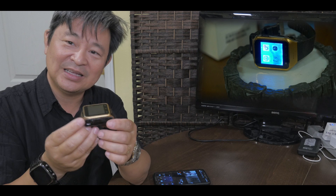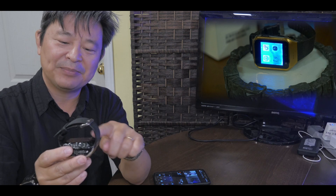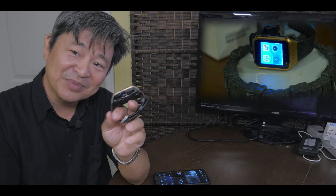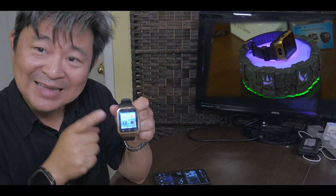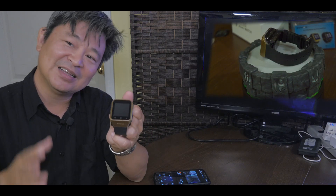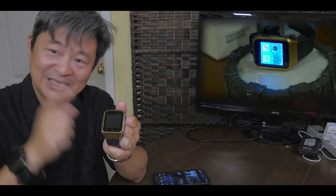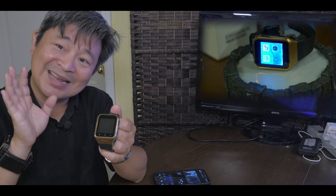The next one — let me show you this one. This one looks a bit bulky, as you can see. I put the battery actually underneath it, then used resin from a 3D printer and coated it using UV light, then painted over it with black paint. Again, it looks quite ugly, but very powerful because the battery here originally was a 400 milliamp hour. Now it's 1850, and look at that — 98% still left in battery capacity. In its original form, it would probably only be around 80%. With the original battery it may last a day, maybe not even that, but now it's three and a half to four times more powerful — since it was only 400 milliamp hours, it can last four times longer.